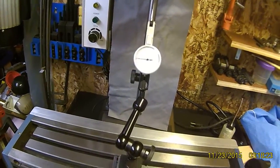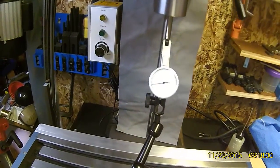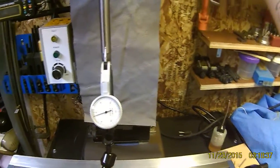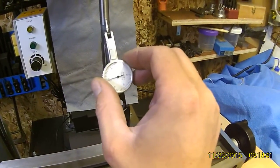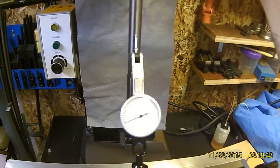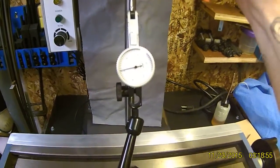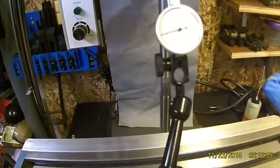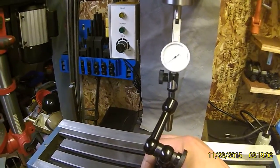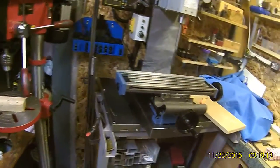Some of what you're seeing here is actually the reamer is probably crooked. I'm not sure what's going on here because I just measured a minute ago and it read zero all the way down. Maybe I had some load or something bound up in there. I almost rammed it in there. So we're twenty-five ten-thousandths of an inch over the same four and a half to five inches — I'd say that's pretty damn good for a mini mill.